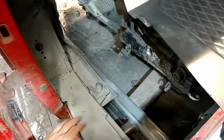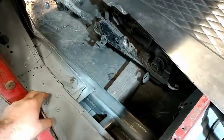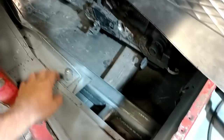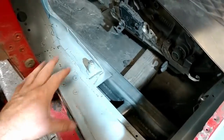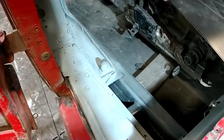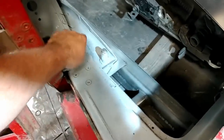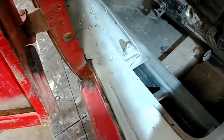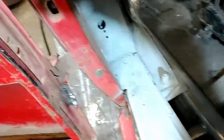For some bracing in here I've added some square tubing through this area right here. These panels and all of this basically just went together with some screws, so it kind of felt like it needed a little bit more support and maybe some welding. So I went ahead and welded this seam down there, welded down all through here, welded a bunch of stuff behind the square tubing, and then I added that square tubing in there to make it all a little more rigid.